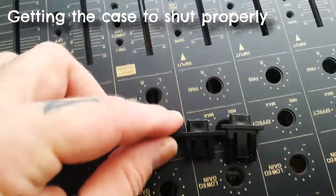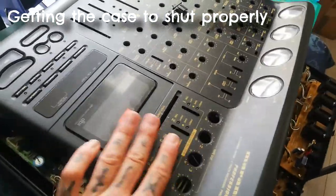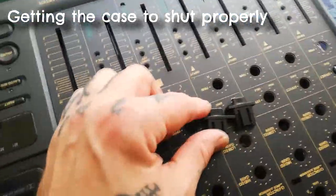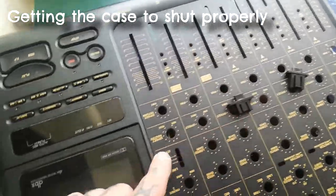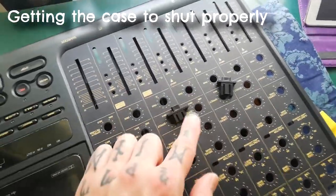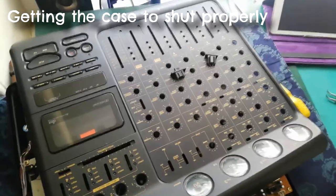I hope you can see there, they're two different heights. Obviously the higher one is to accommodate this slightly raised area for that speed control, and then the lower, shorter one is meant to go there. So clearly this was jamming this longer switch up against there and preventing these buttons from coming through. So if I swap those around, then presumably that's all going to be hunky-dory again.